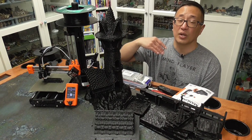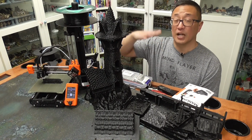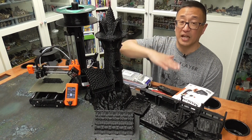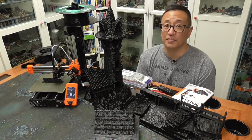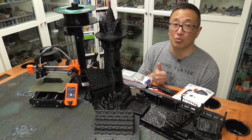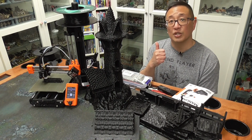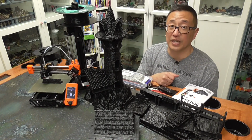And I think that's one of the reasons why it goes out of alignment, where I have to do bed leveling so often, is because that whole build plate is going up and down. Versus the 6 or even the Ender 3, right? The build plate is not moving up and down on the Z-axis, and so I think it's a little bit easier to keep level. But definitely, I think a high priority is having automatic bed leveling. I think that's well worth its money, and so the CR6 does have auto bed leveling, and some of my Patreon supporters who have that machine like it. So I would suggest that over the Ender 3 or the Ender 5.